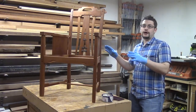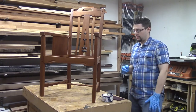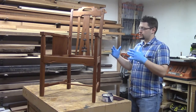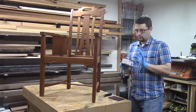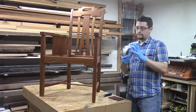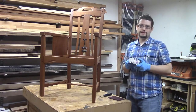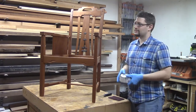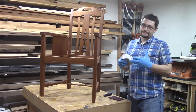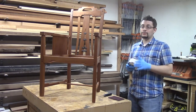At this point, if you want to stop, you're welcome to — the chair actually looks really good and I'm in love with the color. But I wanted to do this one extra step from Christopher Schwartz's finish: apply this Liberon Wax Polish Black Bison Tudor Oak Wax. It smells — I'm not going to sugarcoat it. You want to do this in the shop, not the house, and the smell lingers for maybe five to seven days. Once it's gone, it's great.